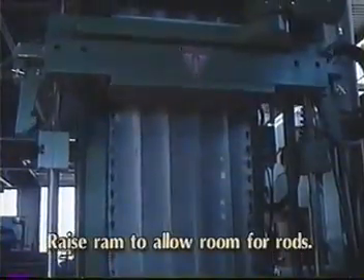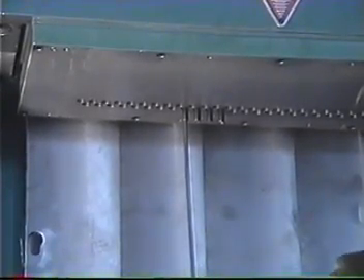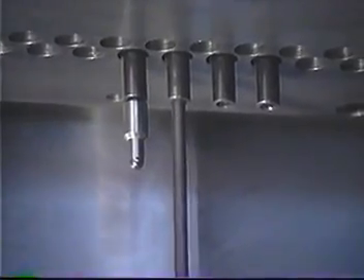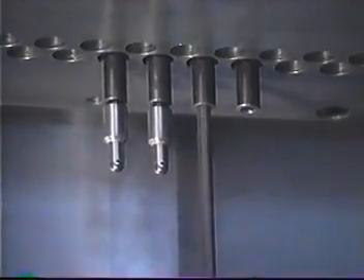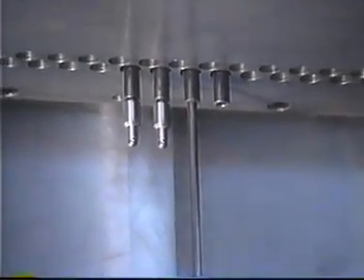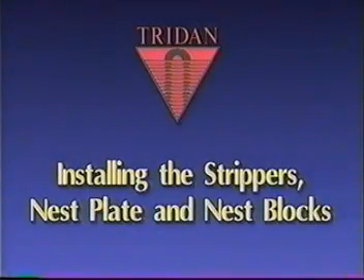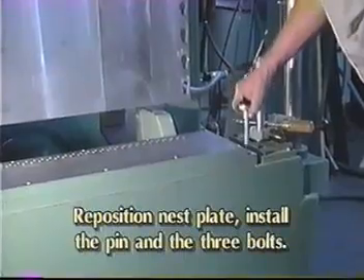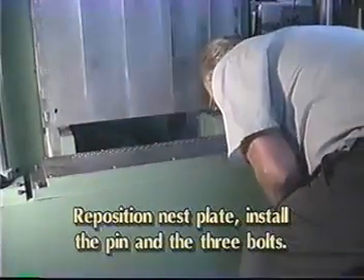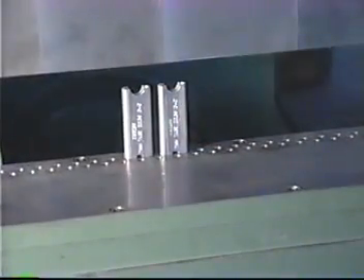Installing the rods: raise the RAM to allow enough room for the rods. Swing the nest plate away from the machine and install the rods — slide them through the final pushers and up to the rod lock plate. The rods also have a notch on the end; generally the notch will face the front of the plate, although your expander may vary. Continue installing rods until you have completed your pattern. The number and position of the rods will depend on the hole pattern of the coil you plan to expand. Installing the strippers: place the strippers into the stripper retainer hole; pushing them in by hand is sufficient. Reposition the nest plate, install the pin and the three bolts, and place the nest blocks into the holes in the nest plate.